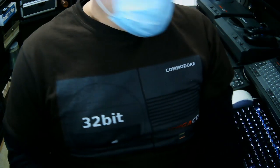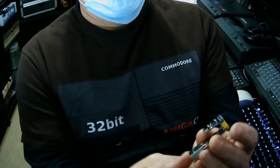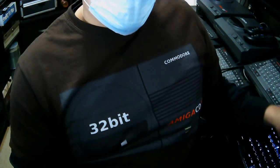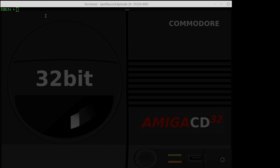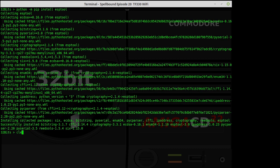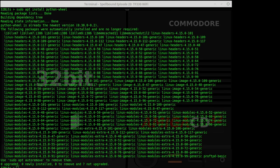You're going to need an ESP8266 Wi-Fi module, and also a way to flash or program that module. I picked up this one along with a USB adapter/programmer for $8 from Amazon — I'll put a link in the description below. To flash a firmware, you'll need to install a Python tool called ESPTool. To install it on your Linux machine, open a terminal and enter: python -m pip install esptool. If you get an error, you may be missing a dependency — the error will tell you what's missing. I had to install two dependencies on Linux Mint 19.3: sudo apt install python-setuptools and sudo apt install python-wheel. When the tool is finished installing, don't close the terminal because we're going to need to enter a few more commands.